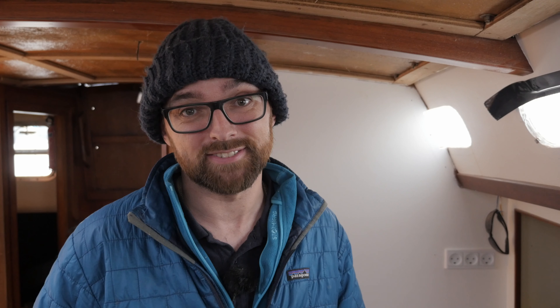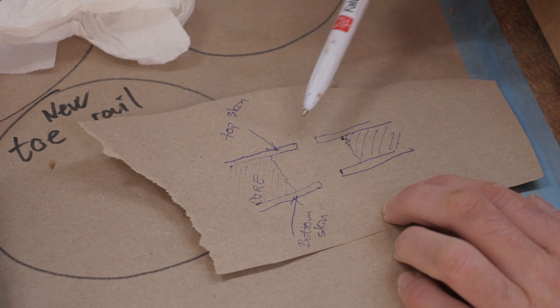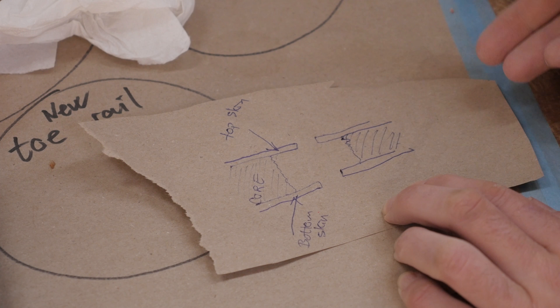The end goal for this method, no matter the name, is to keep moisture out of the core of the sandwich construction. There are a couple of different ways of doing this. If you're drilling in a foam core, you could drill a hole and then use a tool with a 90-degree angle to scrape out some of the core, leaving a cavity you could fill before drilling your final hole. In my case, I don't have a foam core — it's a plywood and solid mahogany core — so digging out that cavity is not really a good option. That's why I've opted to drill a hole and fill it with thickened epoxy. The reason I'm not using screws has nothing to do with holding power — a regular screw will hold a small elephant — but I want to make sure no moisture seeps into the core, because I think one core replacement was plenty for me.